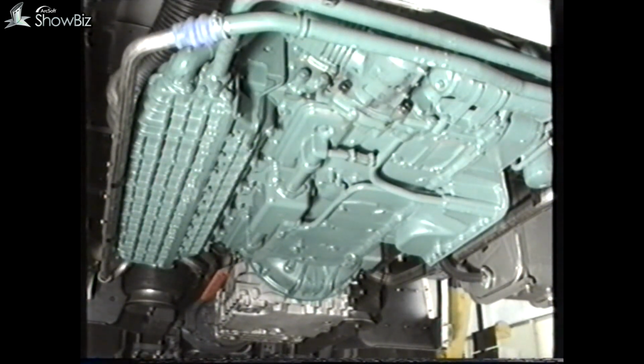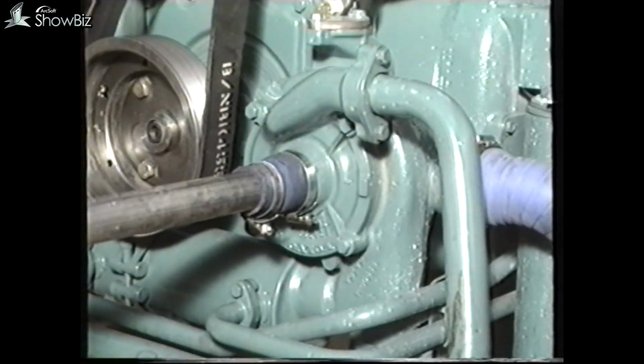It should be noted that if the antifreeze mixture becomes diluted, the water becomes extremely acid, particularly at concentrations of 15 to 20%, even more so than ordinary water. Therefore, failure to observe this recommendation will result in corrosion within the cooling system components and radiator blockage.